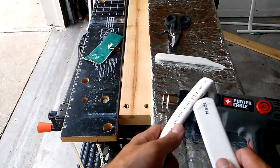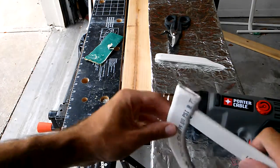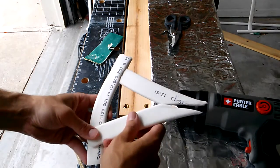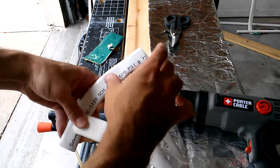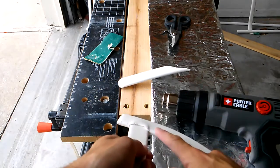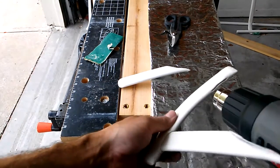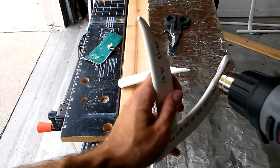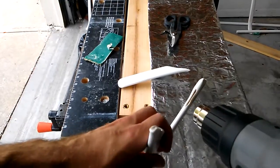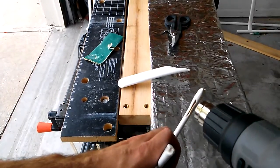Let's take one of these. Very good — that's almost perfect, almost exactly what I wanted to happen. Now let's do the same on this side and see what ultimate angle we'll need. This is going to look really cool. You saw how quickly that heated up — it's just a half-inch Schedule 40 PVC and you're only focusing on one section, so it heats up really quickly. It's almost ready right now — you can see it start to pucker, and once it puckers, that means it's ready.